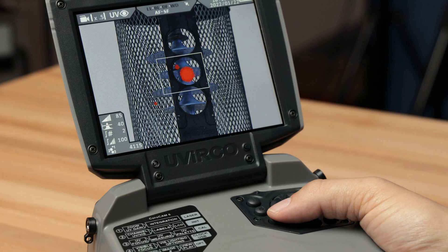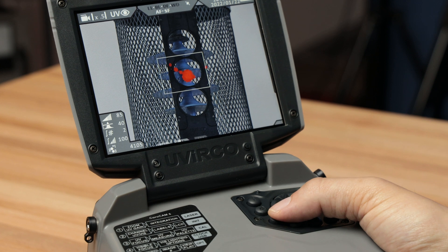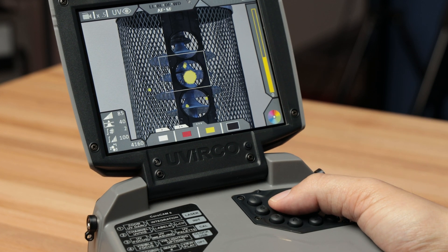When in slave mode, the UV channel is synchronized with the visible channel's focus. Look at the UV color — does it contrast with the background? If not, select button 3, tab 3, and select the color that's most contrasting to the background.